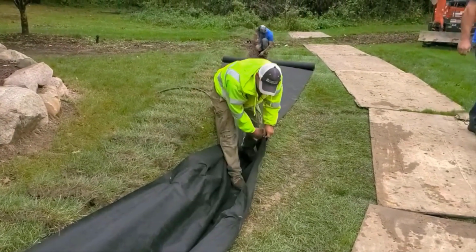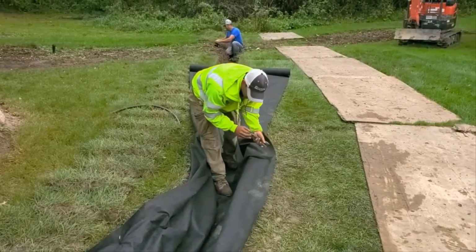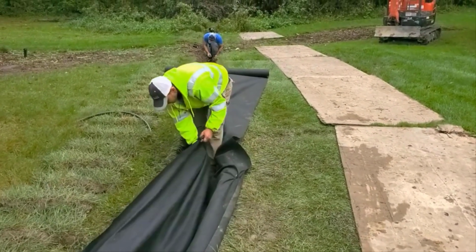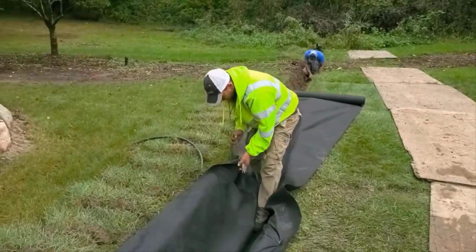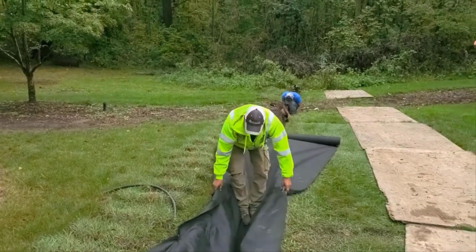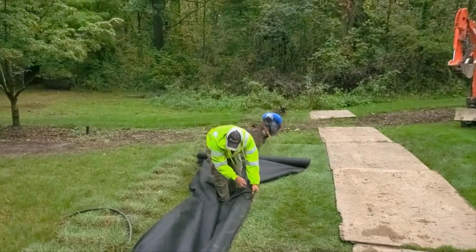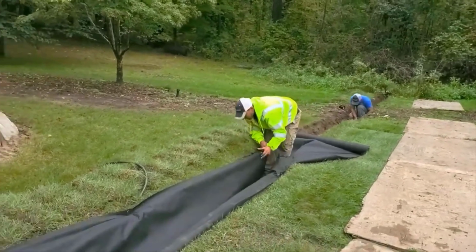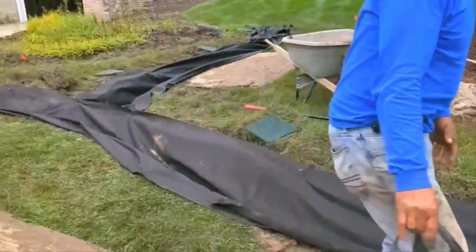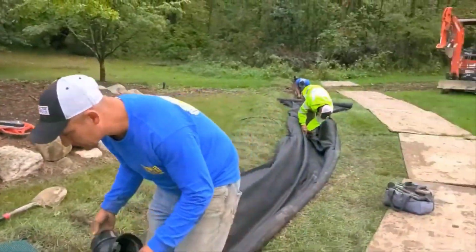Now remember how we do things. We're going to put the French drain pipe at the bottom. That means it goes in before the stone. And if you have a sprinkler system, you want your French drain pipe underneath the sprinkler lines. So when you pull it, you want to pull it under all your sprinkler lines. If you did a hand dig, you probably don't have to do any repair. And again, if you do a hand dig in the spring, you're going to have to work in the mud, but I'm telling you, clay cuts like butter.